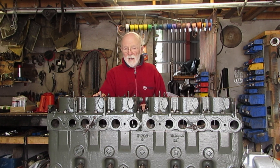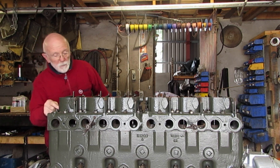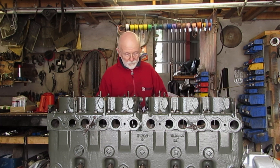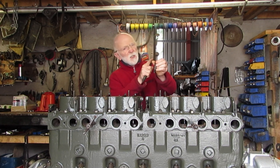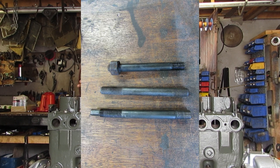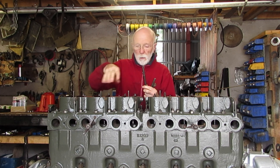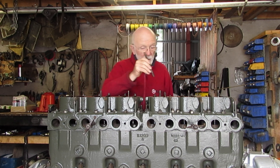Gardners have made life quite easy for us when it comes to lifting. You'll notice on here there's an extended stud — here there are two, and here there is another one. That's a conventional stud for comparison; you can see the thread length on top is about an inch or so. That's one of the extended studs that go on the end and in the centre. And that's one of the special studs — you'll notice a threaded hole in the top, and that's where one of the long bolts go down through the rocker covers to engage in that hole. There are two of these in each head.